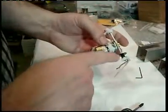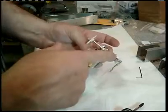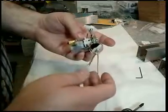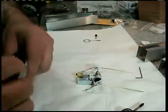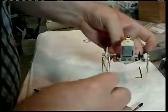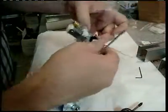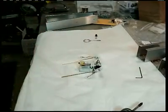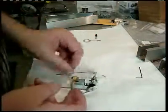What I would normally do at this point is take a small screwdriver and put a little bit of goop on the threads of the screws on these back sides, so there's no way the screw's going to work loose, or worse yet, work tight on its own and bind things up. And you don't really need to do that on camera, but it doesn't take but a second. Just scrape up a little bit of glue, hit it on the threads there. And the good thing again about the goop is if you need to take that apart, you can grab that stuff, because it's like rubber cement, and you can yank it out of there and you can still get the screw out, but it's not going to come out on its own, so it's pretty handy.